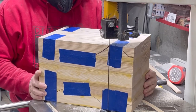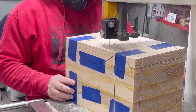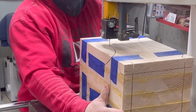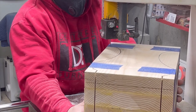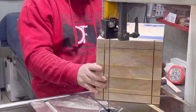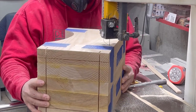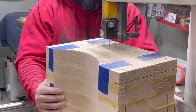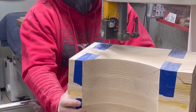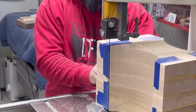Now it's time to head back to the band saw and make our final cuts. Remember, keep the flat side down the same way as before. The reason for taping the pieces back on is to ensure the block stays stable and balanced so your cuts are nice and straight. If you didn't tape them back on, the piece could wobble and your cuts would be uneven — taping keeps everything balanced so your pattern looks consistent all the way around.